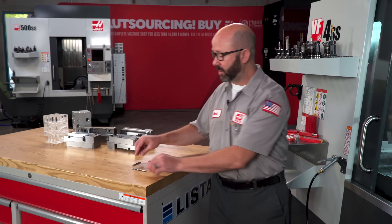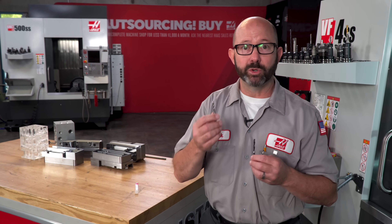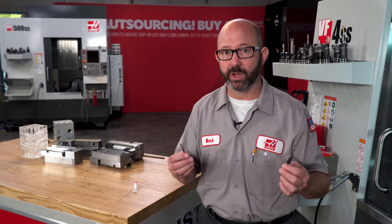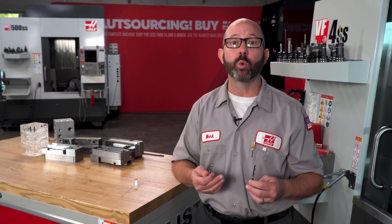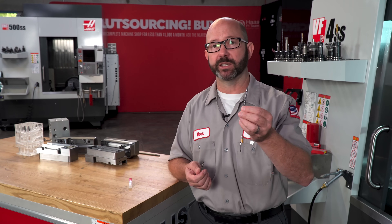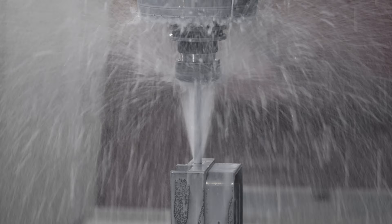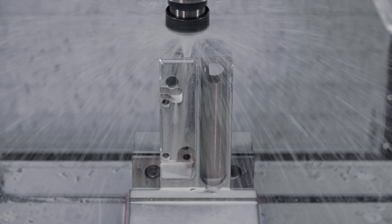On a side note, if you're having tapping problems where your tap is breaking on some materials, the root cause might not be what tap we're using — it might be what drill we're using, or what kind of drilling cycles. If we're peck drilling with flood coolant, with each and every peck we're adding more heat into the material, and that heat can work harden our hole on a lot of different materials. The solution: go with a TSC drill. By using a TSC drill, we're removing all those pecks, we're hitting it one shot — that alone is going to introduce less heat — plus we're cooling the entire length of the hole with our TSC. Problem solved.